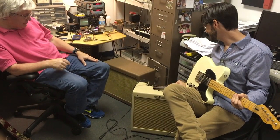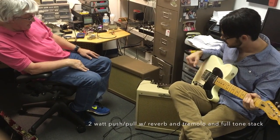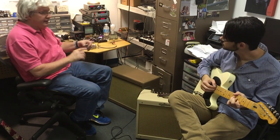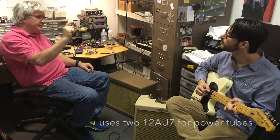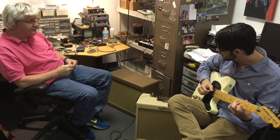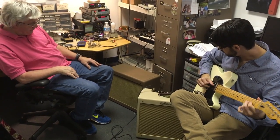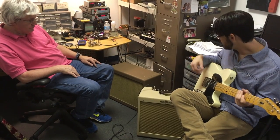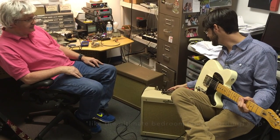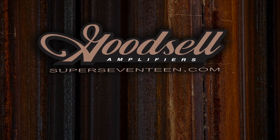It's remarkable in that it's a 2-watt push-pull with a reverb and treble and a real EQ on it. It uses a 12AX7 for the power tube. Really? Like the ultimate practice room amp. Exactly. I'm hoping that whoever is shopping for one of those recognizes that.